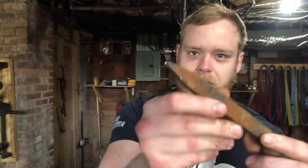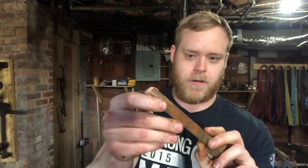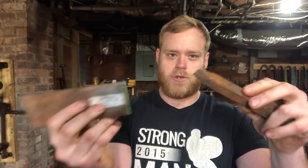What I'm going to make is a meat cleaver-style knife with a railroad spike handle. I've got a railroad spike with a channel cut in it using an angle grinder as far back as it'll comfortably go. I'm going to use a hot cut tool to split that back about another half to three-quarters of an inch. I've got a quarter-inch thick by two-inch wide chunk of 1075 — the same steel I use for my axe blades. We're going to forge weld that in and see what we can come up with.